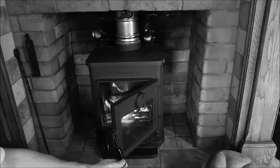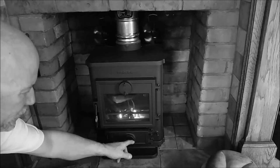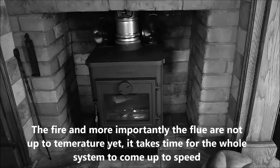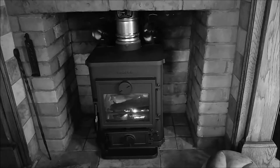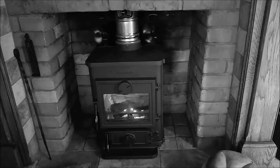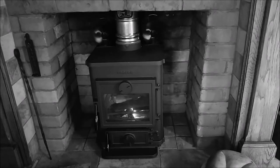If you now shut the door you can see how the fire is damped down, and with the bottom vent closed for wood it goes really low. But as the fire picks up, this top vent will give you a beautiful flickering fire — it takes at least an hour to achieve that effect. If you want to push the fire a bit harder to start with, you can just open the bottom door and let some more air into the burner — that ignites the fuel quickly — but not for long; shut it again and let the fire build up gently. The fans are turning slowly at the moment but in about 30 minutes they'll be going flat out, silently pushing all the heat away from the unit.